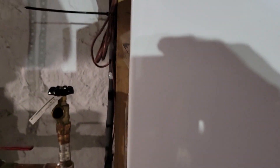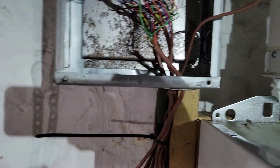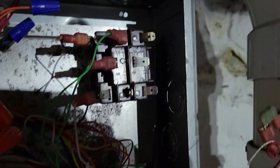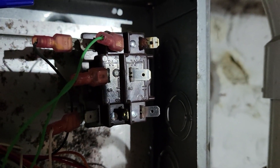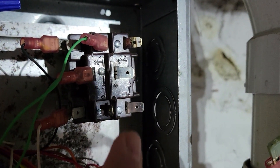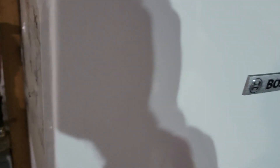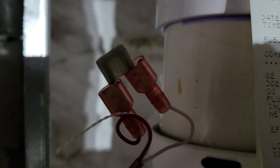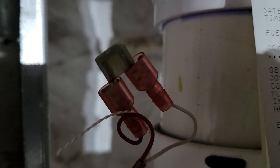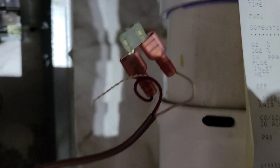Because the two systems are tied together, we need to separate them. My HVAC guy identified a relay box next to the boiler with a cover plate. Pull that off and on the right side you have two low-voltage prongs — your thermostat is 24 volts. If you put a voltmeter on them you'd get 24 volts, confirming power is present, but it's not energizing the rest of the system. So what we do is pull off the positive and negative on that relay and jump them with a piece of wire — we used a fuse — to complete the circuit.